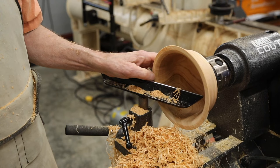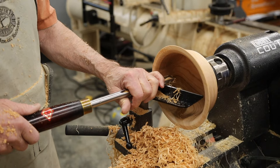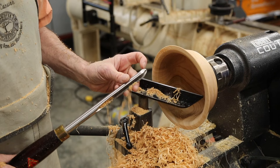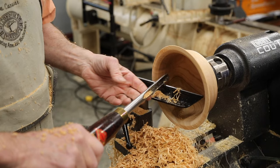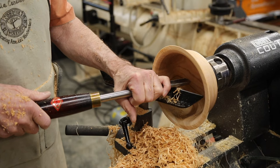So that's the trick to using the bowl gouge and directing it: just remember that quality of the cut is controlled by turning it, and direction of the cut is by swinging it, and you're always rubbing that bevel right behind the tip on the cut. Pushing along the axis of the tool is what drives it. If you try to move it with your left hand — which is a natural thing to do — you will not get a smooth cut and you will not get something you're proud of.